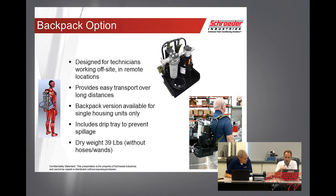I can see here you have one filter placed on the backpack — any plans for dual storage? Not at this time, because if you look closely, the filter and pump motor group are on the same side. On the dual unit, the pump is on the other side with the two housings, so there's not enough space — otherwise it will get too wide.